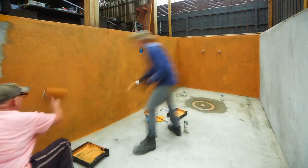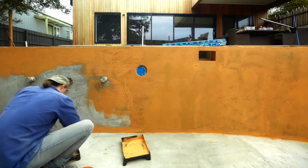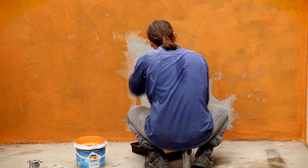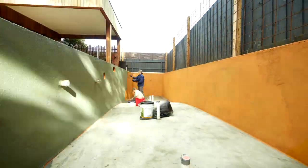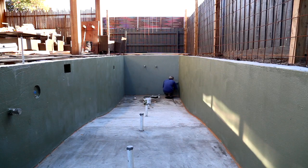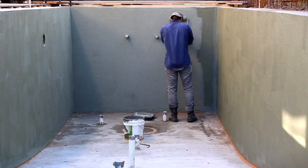When it comes to building any pool, the most important part is that it can actually hold the water in, so using a specialist pool waterproofing membrane is an obvious choice. A fluorescent orange ATA primer is the foundation coat, forming the base for the upper two layers to come. The ATA waterproof membrane is then painted on three layers thick — these olive-coloured coats are the critical point, being literally the only thing keeping the water inside. In this case, the floor waterproofing was left until last to prevent damage to the critical membrane during the tiling phase.